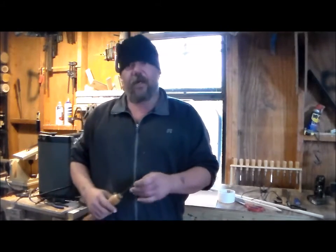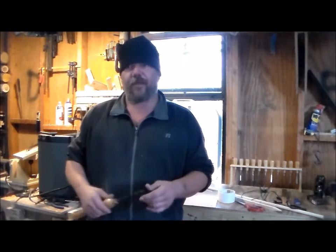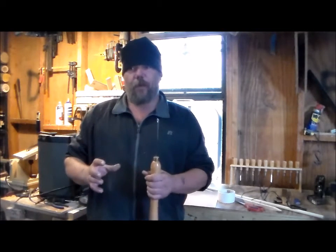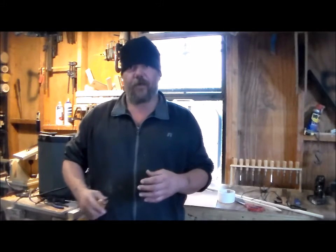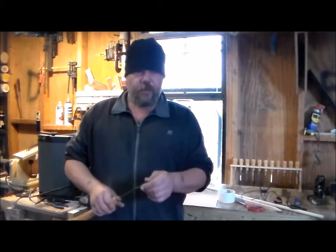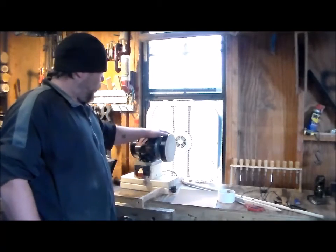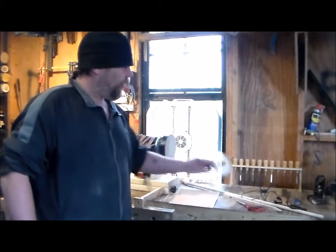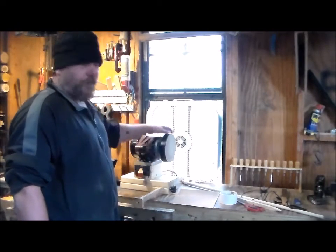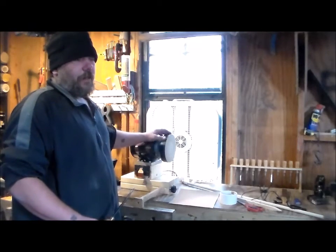What I do have is a motor from a Harbor Freight cement mixer and a balance wheel, or flywheel, from a treadmill motor. Luckily it was the same spindle size, so I put those together and built a little stand for it. What I've been doing is taking some of this double-sided tape, putting it around the wheel and putting sandpaper on it. And I've been using 300 grit.